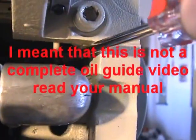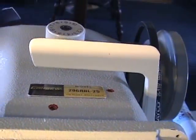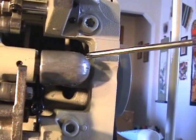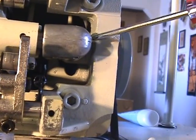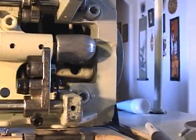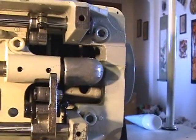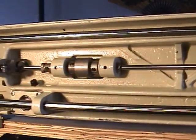Here's where the ropes go through right there — you see them. The oil from the front of those little red spots is up there. Really pay attention to where things are going. You can take this screw — there's one of these up on top under that big cover. You can take that screw out and there's a set of gears running there next to each other. They've got a little white lithium grease smeared onto the gears in there — you probably want to put a little grease on it once in a while, take it off, and put it back on. Read your book and make sure you oil everything; I haven't shown you everything, so do a good job.